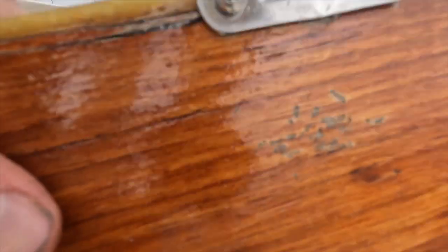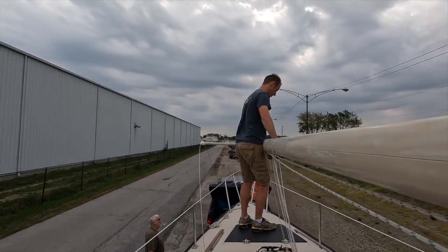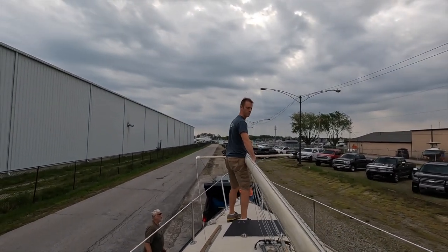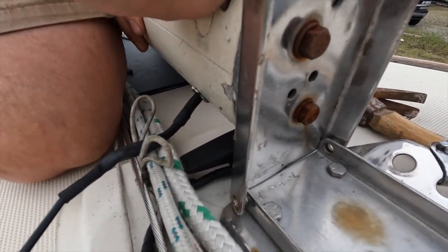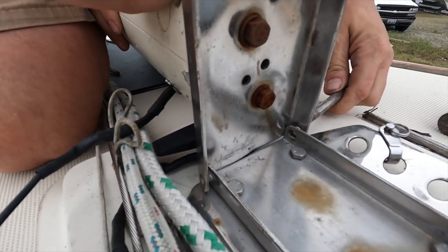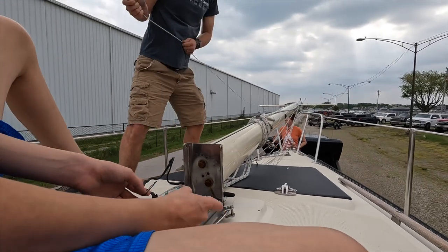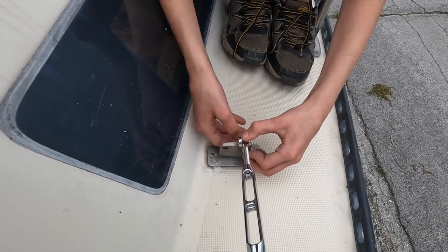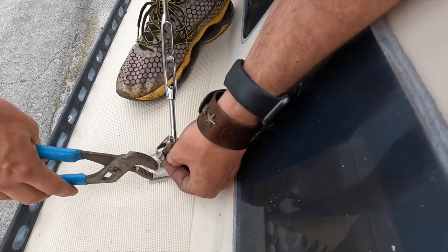Setting up the boat usually takes a few hours — the boat gets packed up for the winter and things have been stowed. We start by getting the mast set and the pivot pin installed. This year we got new standing rigging for our mast — new stainless steel cables that hold the mast in place. The stays and fore stay get attached to the deck and chain plates. Then we hook up and test the mast lighting. Welcome to boat teaching with Dad.